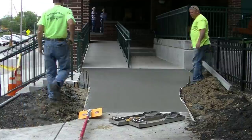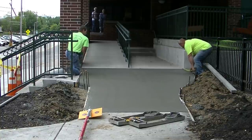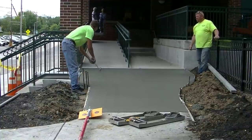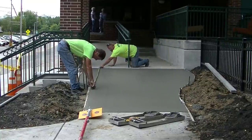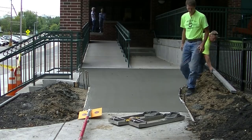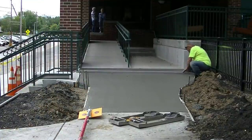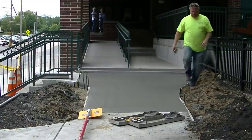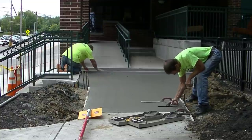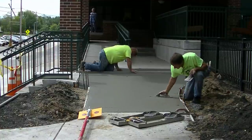What I'm doing right now is measuring out where we're going to put our first groove. We're cutting two grooves in this thing — these grooves are supposed to help the concrete crack in the groove, so if it does crack it'll still look like a groove and not a crack. We're putting them right where the engineer told us — this was actually engineered — so they're handling all the responsibility of the concrete cracking and we're just doing what we're hired to do. We're using the 10-foot screed as a guide to make the groove nice and straight.